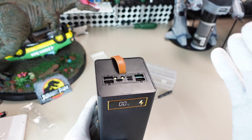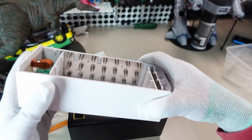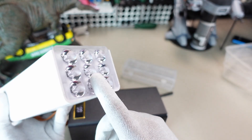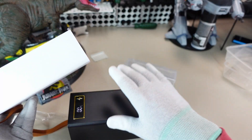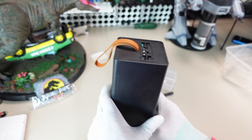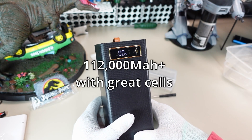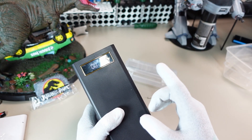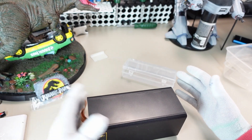Especially if you can't afford one of those big camping power stations, this would be a treat. Don't get it wet obviously. During blackouts it will just keep going and going. There are other variants — one with a wireless charger on top, another with a different type of light. Hopefully they'll release one with a COB LED — that would be kick-ass. Anyway, that is 32 18650 cells — a DIY genuine 100,000 mAh power bank. Do it yourself only if you're confident with electricity and batteries. If you're a regular person, just go to your big box store. Hope it's been interesting — take care, see you later.